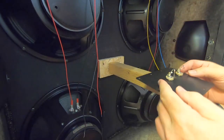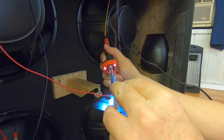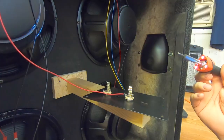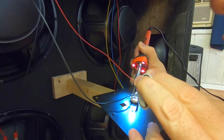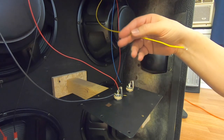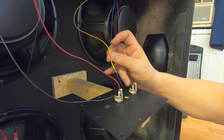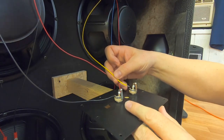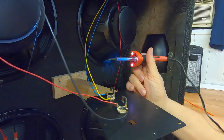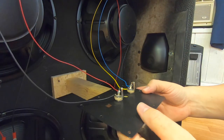Let's solder these jacks here. Here's the hot, which is right here. Beautiful. Here's the ground. Over here, remember yellow was ground. So we look for the post that would be on the ring that comes across, which is right here. Blue is hot. Yes. Beautiful, man. That's factory.